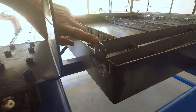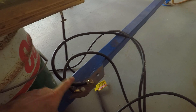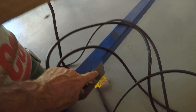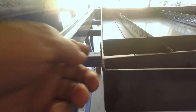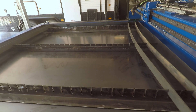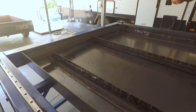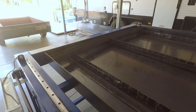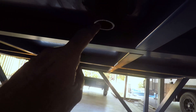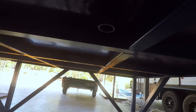Around the back there's a gap, but that's okay — the torch doesn't come this far. I've also welded a little tab with a hole so I can run an earth strap from the water table down to the common earth point. One cable comes out of the plasma cutter, the other is my ground clamp that goes onto the piece. I've got a spare hole where I'll run a cable and bolt it up here — so if I forget to clamp the earth clamp onto the metal, I've still got a good grounding through here. I'll line up the slat frames, put tack welds front, middle and back, and put all the slats in.